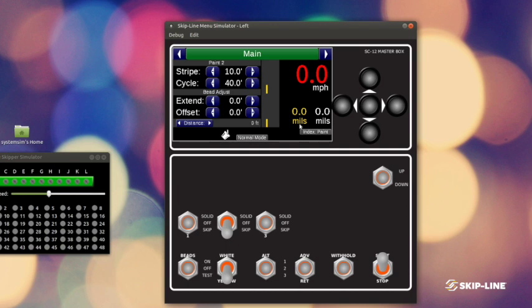Now in real life, that's not actually how things work. Variances in pressures and temperatures change a lot of things, and then if you've got any sort of wind element, that can also change things. So generally, especially with type 1 beads, we look for additional bead coverage, meaning we actually want beads to extend after the line, as well as overcover before the line.